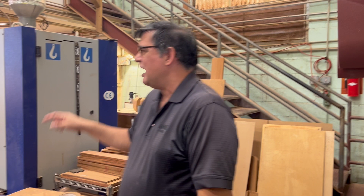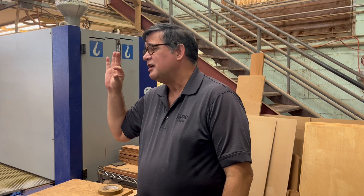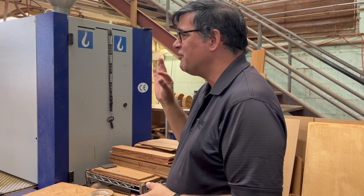If you've never seen one before, this is what's called a thickness sander. It's got big sandpaper belts spinning inside — you feed your wood through on the conveyor belt and you can get very precise, flat thicknesses. When we first cut our wood, we cut it at about 3/16 of an inch; by the time it comes out of here it's about 3/32 of an inch. Every top has a different target thickness though — the 6- and 8-string models are thicker because there's more stress and tension, whereas the standard and concert sizes have less tension so they can be thinner.